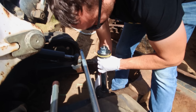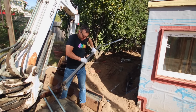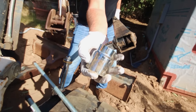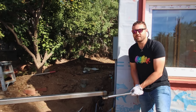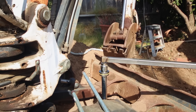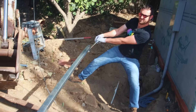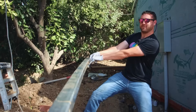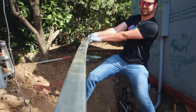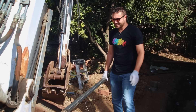It's torquing time! Don't buy new things. Don't buy a vise. Don't buy the right tools. Just use what you've got. How does my DIY torque extender multiplier work? Put your big socket on. Based on some simple math, if you put 200 foot pounds of torque right there, it turns into about a thousand foot pounds of torque right there. Once this clicks, it means there's 200 foot pounds generated there — times five feet is a thousand foot pounds. Watch this whole nut shear off. There it is! So you see how the bar is deflecting? If you were to measure the angle of deflection, you could literally measure your torque based on the deflection of that bar — that's how the torque wrench works. Now we've torqued our nut to a thousand foot pounds with a torque wrench that cost $150 instead of $500.